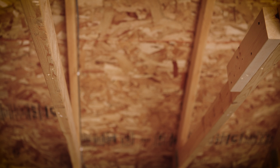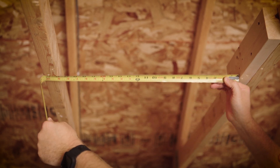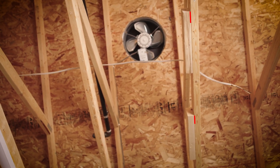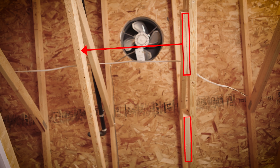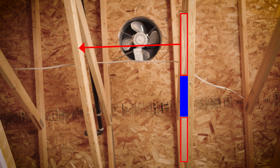When installing the unit into a ceiling or wall cavity, the minimum distance required between the mounting structure is 20.5 inches. In typical 24 inches on center truss construction, it is easiest to include additional 2x4 pieces where the mounting brackets will be placed while maintaining a gap for extra space for the electrical wiring.